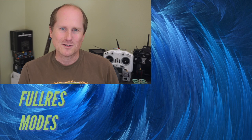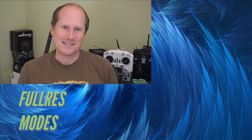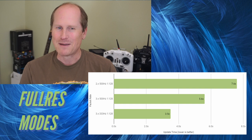In addition to more channels, there's also a substantial telemetry bandwidth increase in these modes. Our telemetry payload capacity doubles, which means higher telemetry ratios are viable. Even with the global telemetry speed enhancements in 3.0, 333Hz is substantially faster than 500Hz at the same ratio, even though its packet rate is lower.